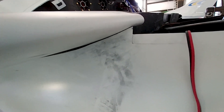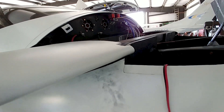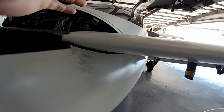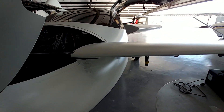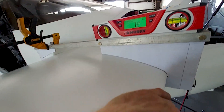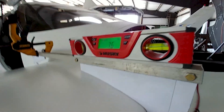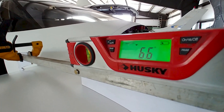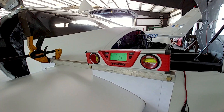After the AC guys left I did some more work on the foreplane — getting it to within about half a degree of being set up right. I still don't have the bolts going through correctly, so that's the job for Monday. The elevators are on and all the hardware is done. You can see when I push down on it I get close to the angle I want, which is 6.6 degrees right now — I just need to do a little more fairing out to get it in place.